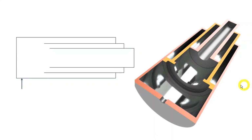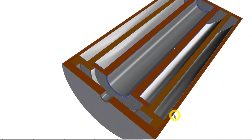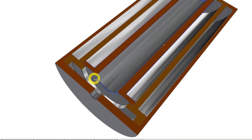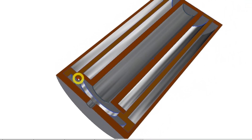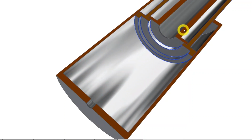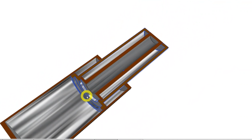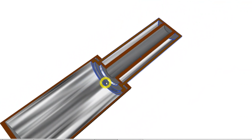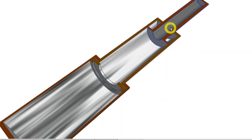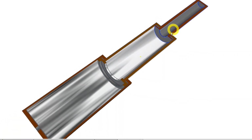This is a telescopic cylinder. In this cylinder, pressurized oil accumulates in the bottom. The pressure will work on the whole area that is covered by the cylinder pistons. The largest cylinder will move out first, as this has the largest area and will create the highest force, followed by the inner cylinder. The middle cylinder will bottom out in the outer cylinder, and then the inner cylinder will start moving. There can be more cylinders than those shown here.